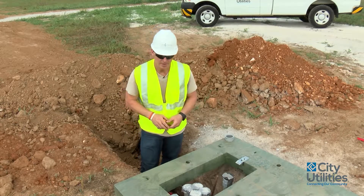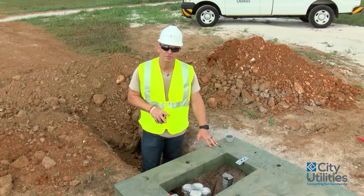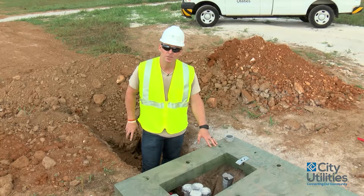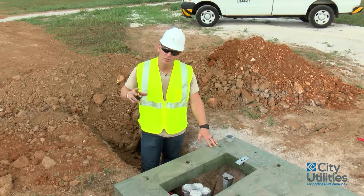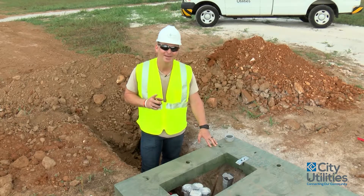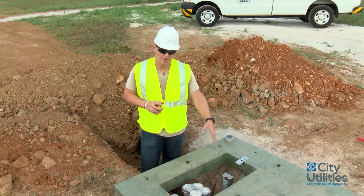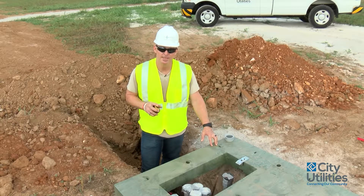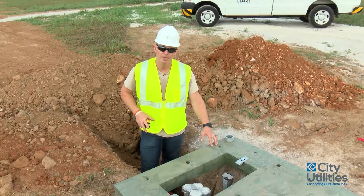Let's talk about the transformer itself and the placement of the elbows. The contractor has already dug all this in; I've asked him not to backfill so I can explain what we're looking at. Behind me is a 36-inch cover of ditch — it's a 38 to 40-inch ditch all the way down. He's already laid in his two-inch plastic pipe and used purple primer and glue. The purple primer helps soften the material and helps things stick together better, so it's less likely to come apart when the ground shifts.